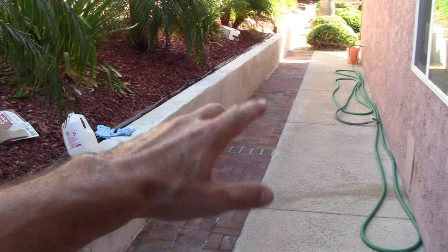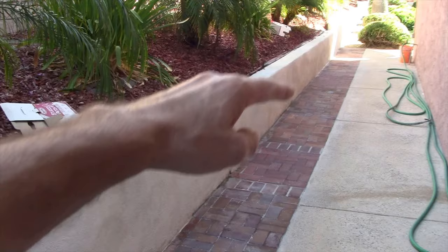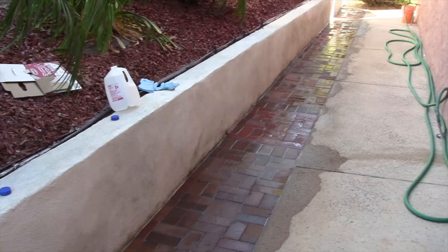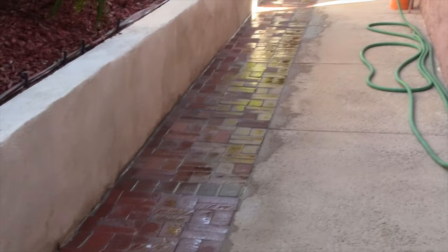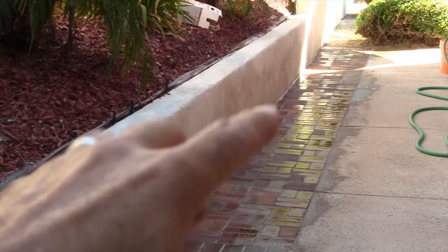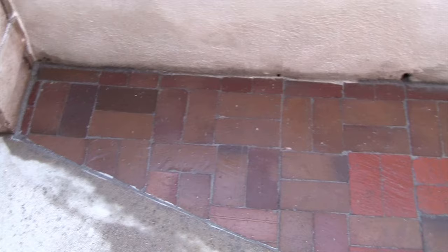It has been a few hours. The brick is dry enough, so I can give it another application. I'm going to do the exact same procedure — put the sand down, use the green push broom, go through the whole thing and try to fill in every little nook and cranny. I've just gotten done with that second application, and that's probably going to be the end of the project. What's nice is that when you walk on these, they are just solid — solid rock hard — so they don't give at all, which I like, where there's no movement underneath your feet. I've pretty much got every single thing filled in really nicely so that no weed growth should grow between the brick joints. I really like that aspect so I don't have to worry about maintenance, and hopefully we'll get many years out of this installation.